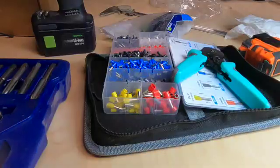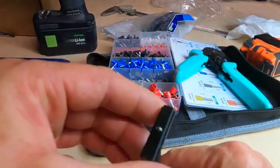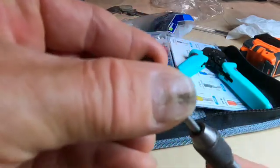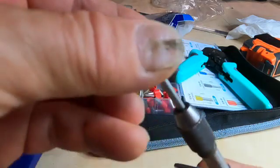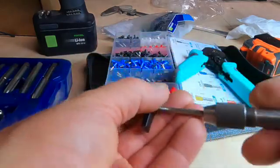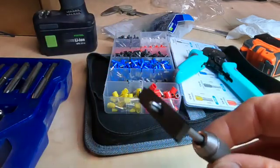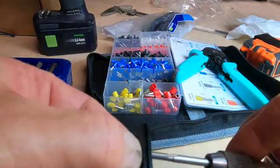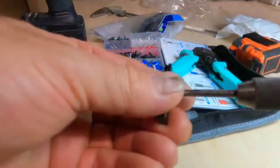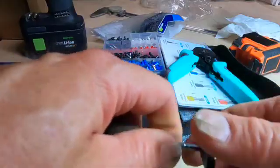It'll look good. On the backside it threaded in very easily. Going toward the front, it almost feels like they didn't even tap the front — it gets really tight. You can see chips starting to come out. I checked to confirm it was the right thread, and it was. The backside was great — just a little QC dimension issue.